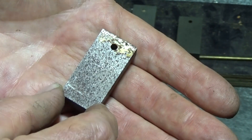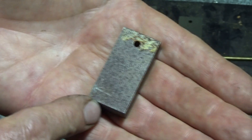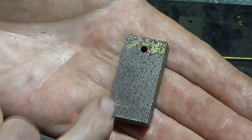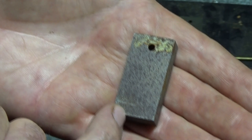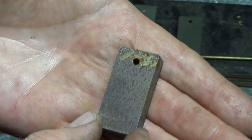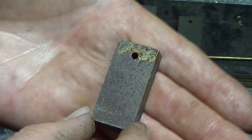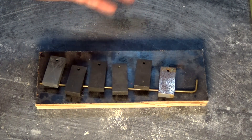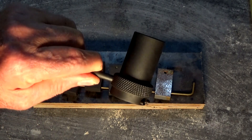This is the control sample. I cleaned it, polished it, handled it as little as I could, placed it on a piece of plywood with the other samples, and left it. You can clearly see the corrosion is well and truly started, and it will only get worse — the corrosion layer traps more moisture and accelerates the process. That's what I was getting with any bright surfaces in my workshop within a few months. This is actually five months on from when I started the test. I want to follow up at 12 months to see how bad it gets. The parkerizing process is a winner for me — I've done a number of tools so far and I'm not disappointed.